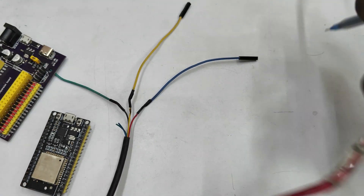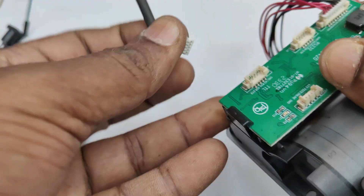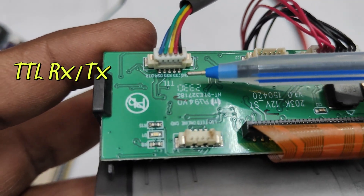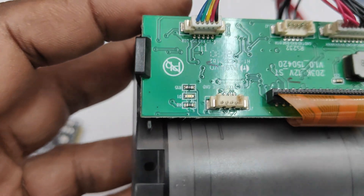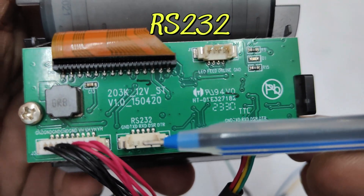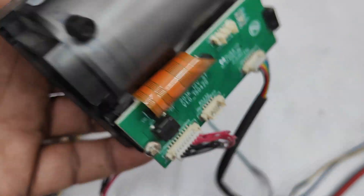The DC supply required is 12 volt DC 2 ampere for the R203 thermal printer, and the communication protocol is TTL. At the end of the PCB there is a bunch of wires — these are the TTL RX/TX pins. We will be using only the RX pin and ground to communicate with the ESP32 38-pin version. This printer is also capable of RS232 communication, and the red and black bunch of wires on the left side is for the power source — 12 volt 2 ampere minimum.